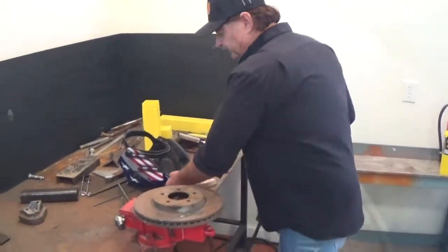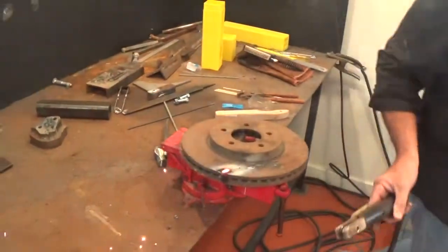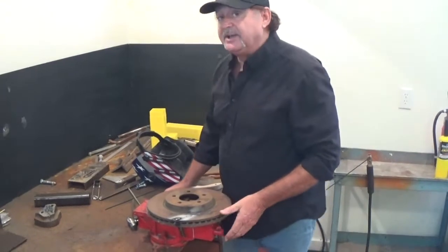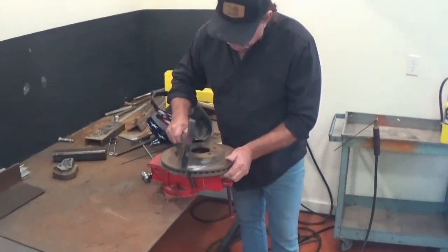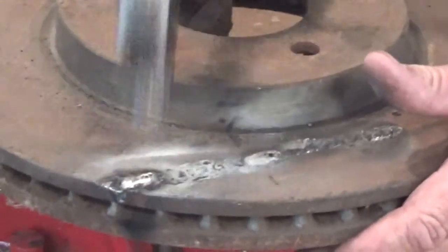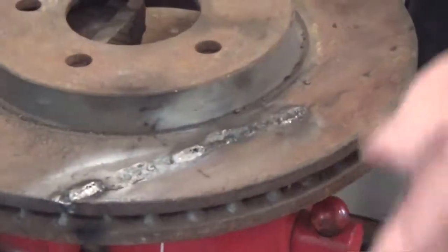I'm going to come to the other end now. The beauty about this Vulcan 500 CI is it's so smooth. You can whittle on this with your pocket knife — you won't hear a machinist in the corner cussing and chattering after you've welded a casting because he can't cut it. This will be nice and soft. Repeating the process, keep chipping our slag. Look at this deposit — see how nice and smooth? That weld deposit's looking like a battered fishing spoon.